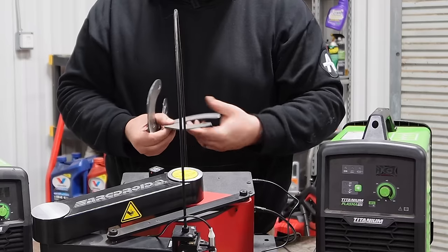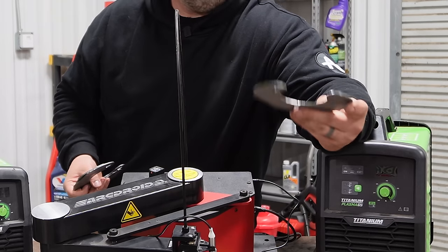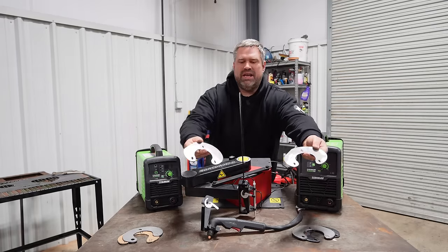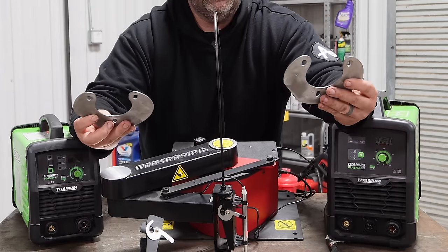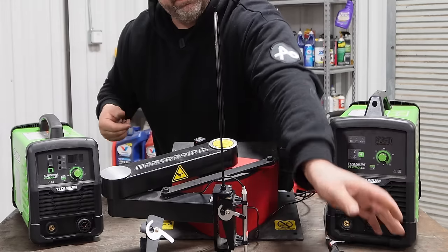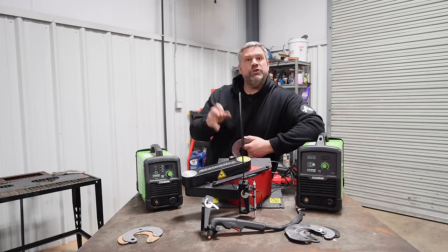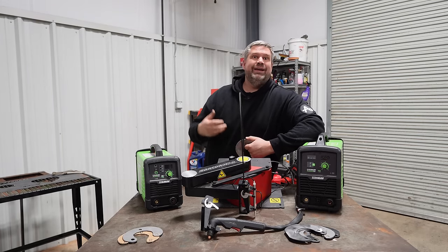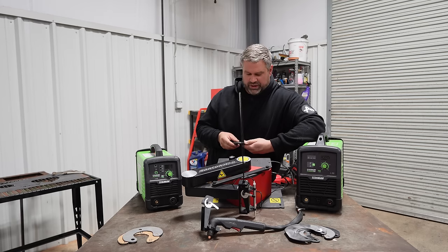And again, for some reason on one of the cuts, it just didn't drop and cut that other hole. Don't know why. I can learn it. But I was able to get two fairly usable pieces, but the holes weren't very perfect. And I wasn't thrilled with that. So this is where one big benefit comes in. Once you have traced something, you can save it to a jump drive as G-code, take it to your computer, and then dress the drawing up a little bit, correct a couple things.